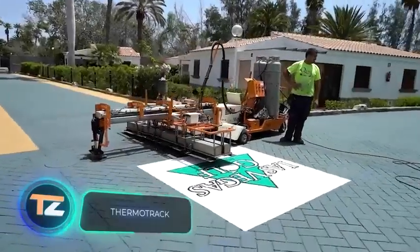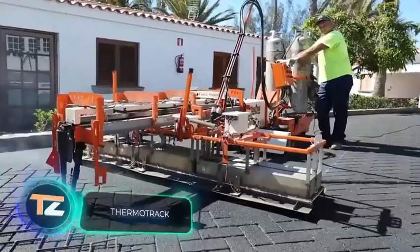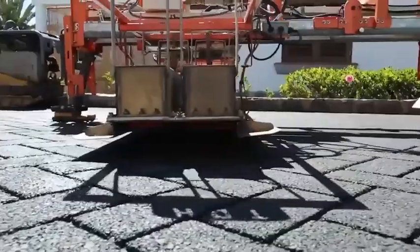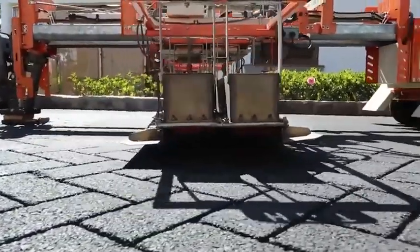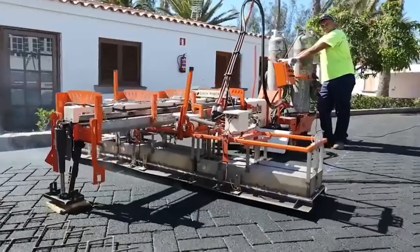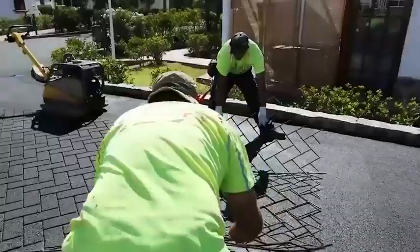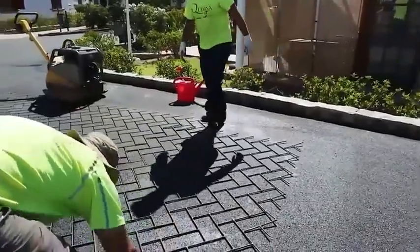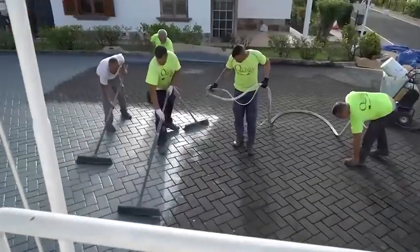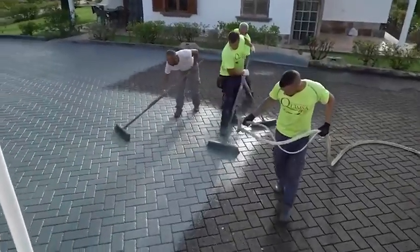How can you upgrade an asphalt surface? Just use this stamping system to change not only the appearance, but also the characteristics of the asphalt. The work is done in several stages. First, special molds are pressed into the heated surface using heat motion or a similar technology. Then, additional coatings are applied, and at the same time, the resulting tiles can be painted in different colors.